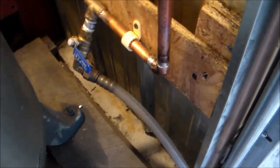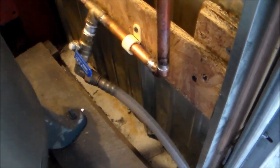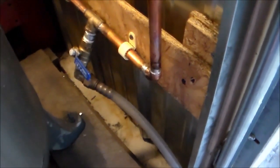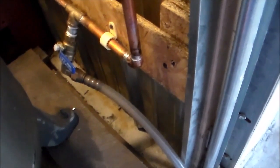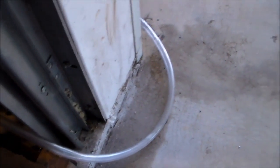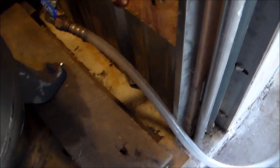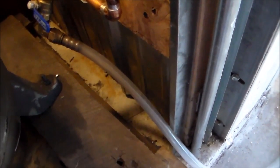Down at the bottom I've got a ball valve at the bottom of this loop and it works as a trap to catch any moisture that might collect in the tubing. I ran a clear hose that goes outside the door, and that way I can bleed off any moisture that might collect in the bottom of that hose and I'll be able to see it inside the hose.